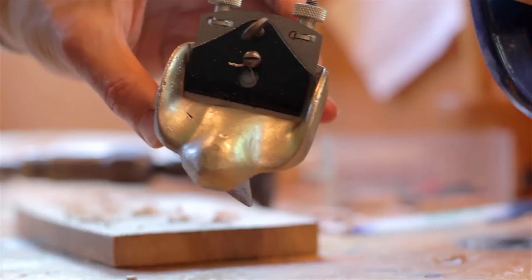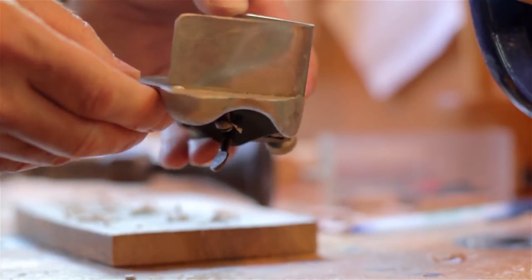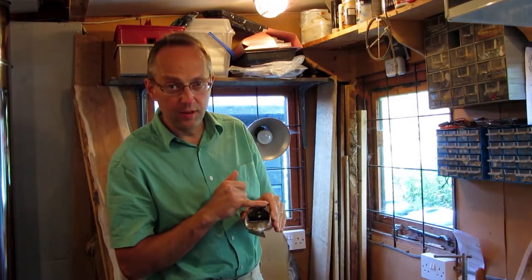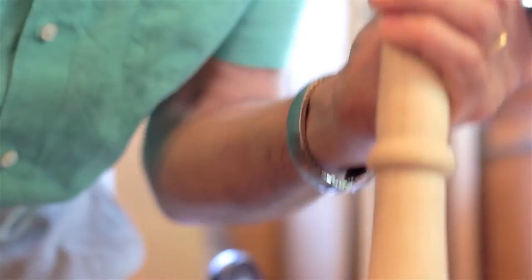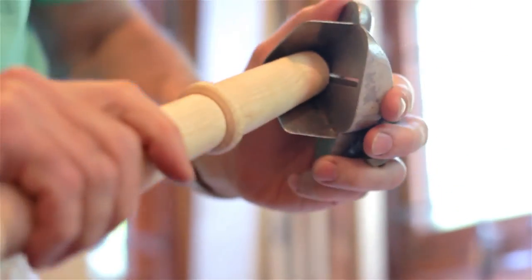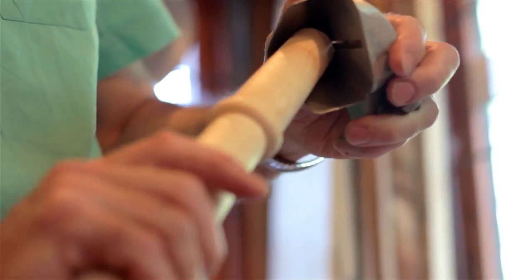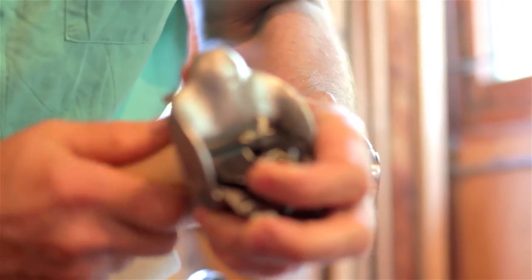The other little tool that I've got is this one, and it's really a mini plane. It's got a flat base just like a standard plane, but it's got this angular fence set at right angles, or a bit below. There's a spokeshave blade put in here and it's just an aluminium casting. It's probably easier if I show this one out of the vise — you put the leg in at a slight angle, pressing it against the metal wall, and turn it, and again out comes a little shaving.